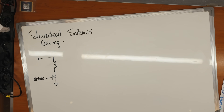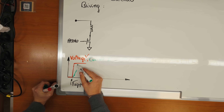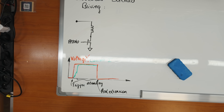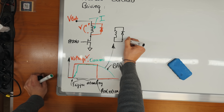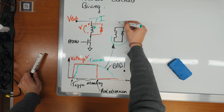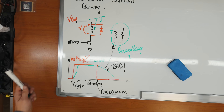One more thing is the way we drive the solenoid. In a standard Nerf blaster you control the solenoid with a switch — you turn it on, current increases through the solenoid. But when you turn off the voltage, there's a problem: there's a lot of current running through the solenoid and that current needs to go somewhere. The way you'd normally solve this is by putting a flyback diode over the solenoid. But this flyback diode allows the current to keep recirculating in the solenoid coil, which actually causes a force on the solenoid when it's returning, making it return more slowly.